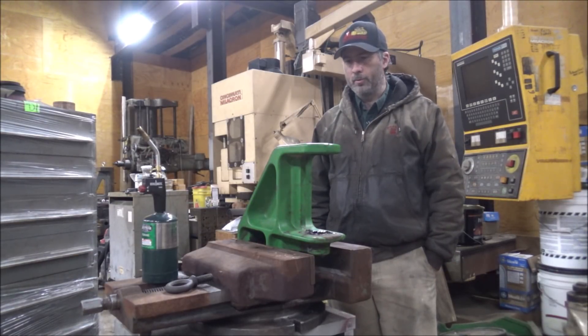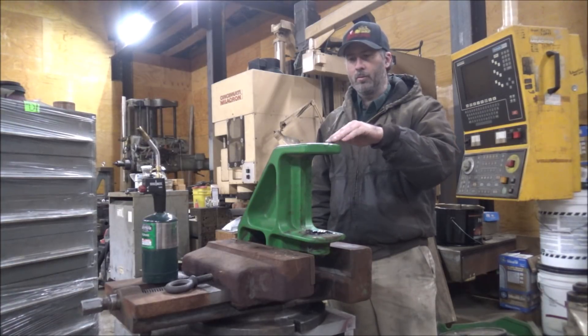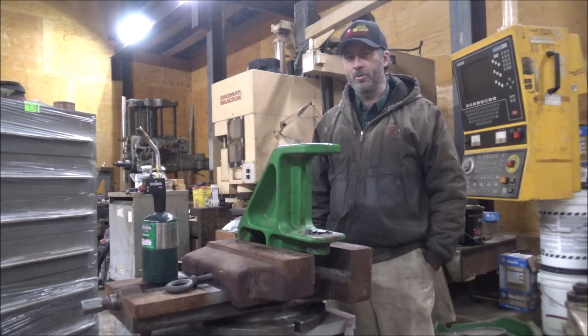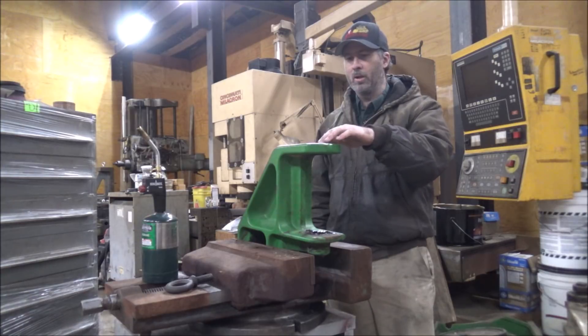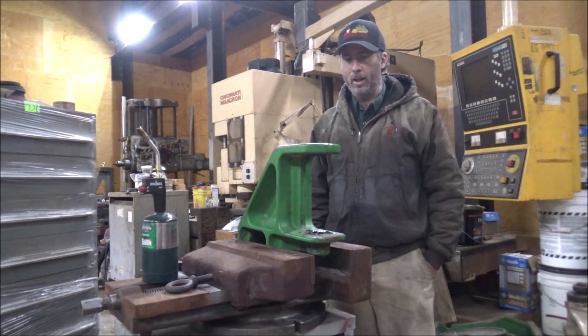So I'm going to take and preheat this, mainly to burn the paint off and kind of clean up the grease and stuff out of the hole to get it prepped. And I'm going to drag the welder leads over here and go in there with some rod and see if it can do a decent job of welding this up and not wind up with something that's so hard it can't cut back out.